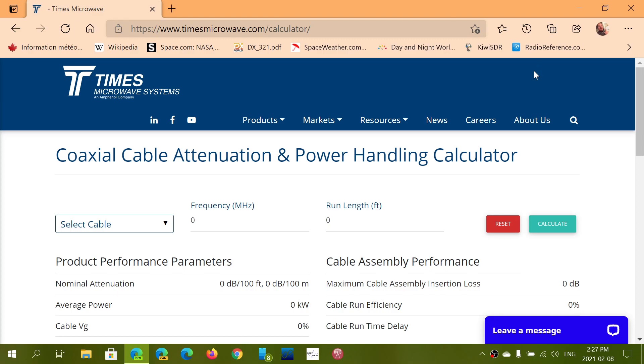If your coax is extremely short, there's not too much cause for concern most of the time. But if your coax is long, you have certain loss within the coax itself, and the higher in frequency you go, the more loss there is. So depending on what you're going to tune — if you're always in the low VHF range it isn't too much of a problem, but if it's GHz that you're trying to tune around, that might be a problem.